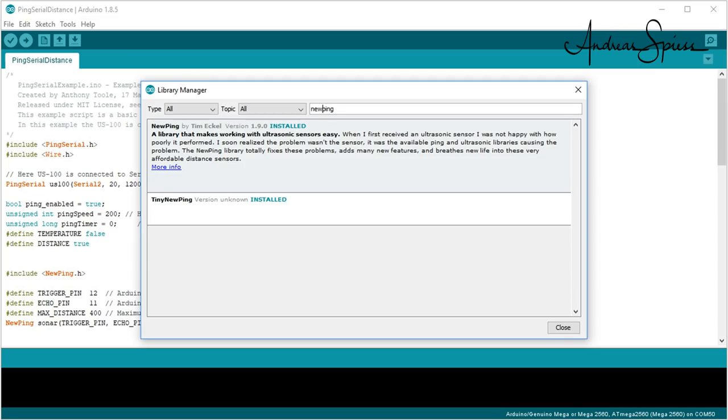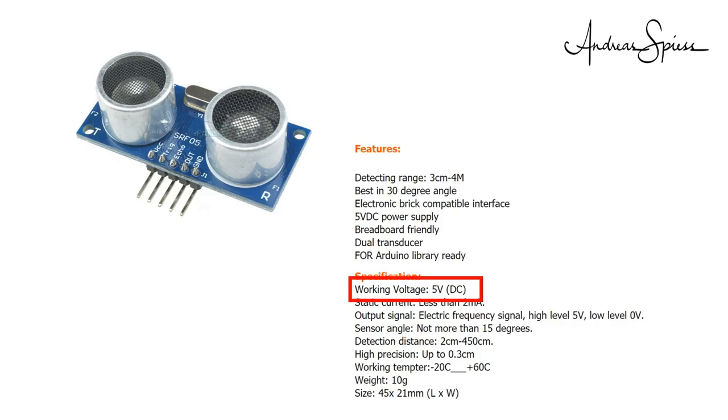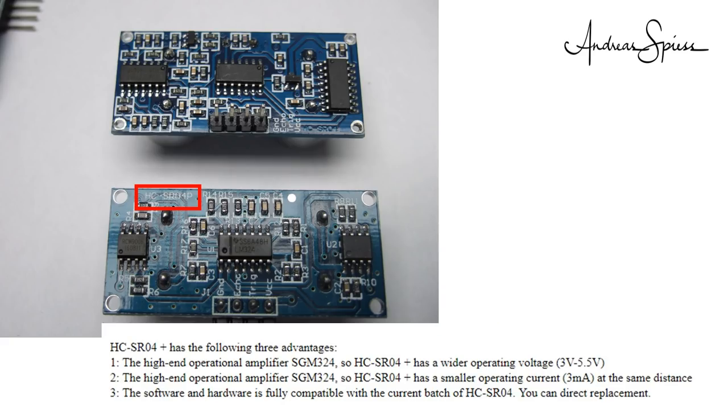These sensors work with the new PING library, and there is also a library available for the ESP8266. These days many micros run at 3.3V. Standard ultrasonic sensors are not specified for this voltage, which is why you now get an enhanced version called the SR04P. It does not look very different, but has a label with a P. Pay attention if you run these sensors at 3.3V, even if they are specified to run — in my tests their range was much shorter, probably because the power of the signal is smaller than with 5V and therefore it does not travel the same distance.